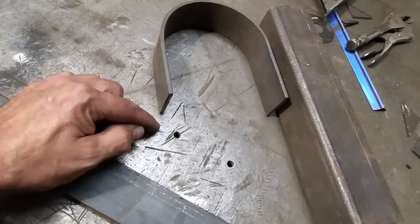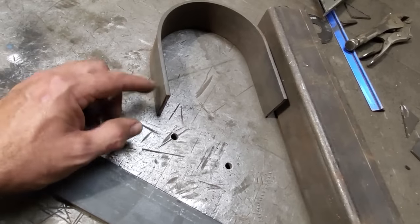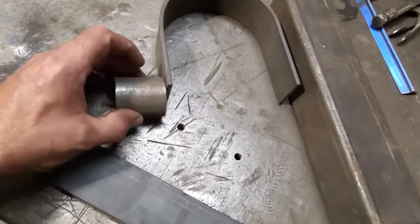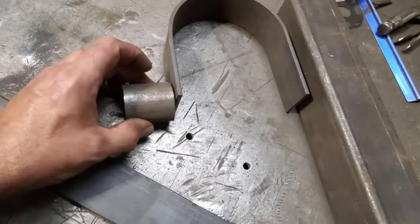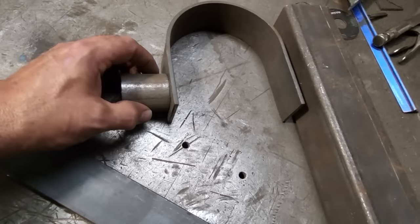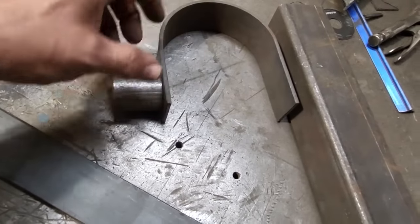And right where they're welded, most chances are, is where I'm going to put a piece of pipe, much the same as this here, the roll bar pipe. I'm going to weld it on there like so, and that's going to be welded to the chassis in the car. You could probably put a smaller piece of pipe on there, but I just assume give something that'll get a bit more bite in it.